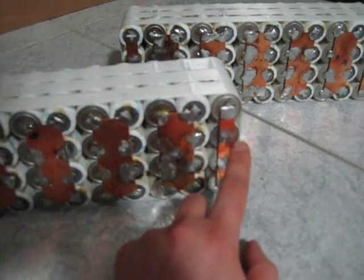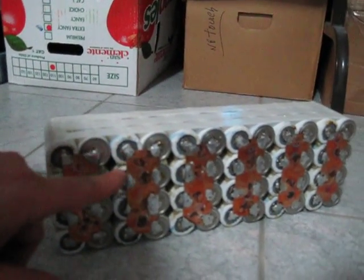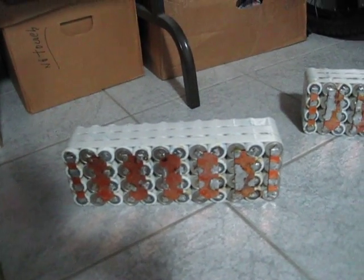Next I'll show you is my A123 pack that I've worked very hard on. These plates — correct me if I'm wrong — I think they're 0.0032 of an inch thick. You can see the tabs are bent over on the A123s and they're soldered to the copper sheets beautifully all the way around. It's held together by polyurethane glue that comes in a caulking tube I bought at Home Depot. These things were a pain to heat up, but you had to get them really hot to make sure they hit the tabs good. I have two 4P 12-series and two 4P 10-series.